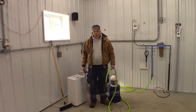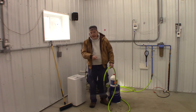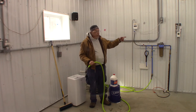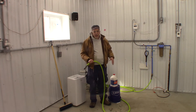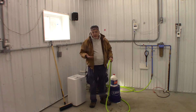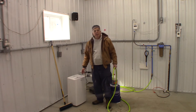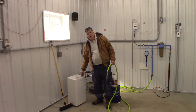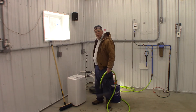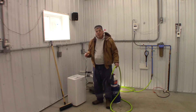What goes out the back — as you learned in chemistry — is going to be dissolved salts: the calcium and the like that leached off the floor. The floor heat is still on, set to 60°, so once I clear the air out, that heat source will help it dry. I also have a dehumidifier because what will be in the air is only water vapor, and the dehumidifier will help dry the room out more quickly. It goes directly into the sump pit and gets discharged.